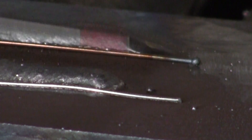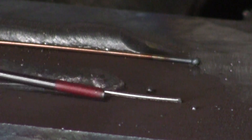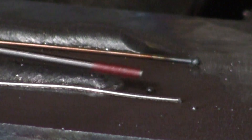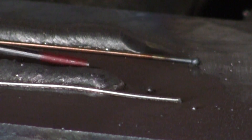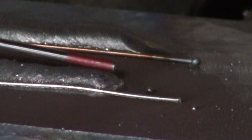Here are the two wires used in these two welds. This is E71TGS flux core wire. The T in that number string stands for tubular, which means the flux runs right down the middle of the wire. As the wire burns off, the flux is provided to shield the molten metal from the atmosphere — oxygen and nitrogen.